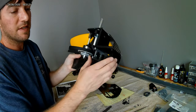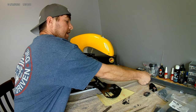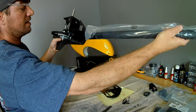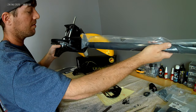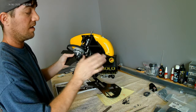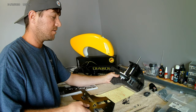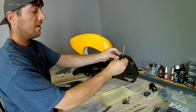When you mount the boom mounts to your frame, you want to make sure they are perfectly square. To check, make sure your tension bolts are loose and you can take your boom and easily slide it through those mounts without much resistance. If you really have to tug, yank, and pry to get that boom in and out, your boom mounts are not square. I didn't have much of a problem, but I did have to tweak it a couple of times.